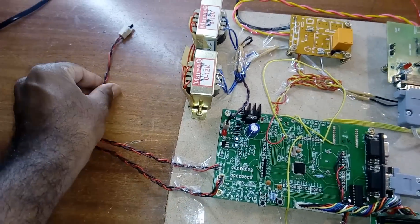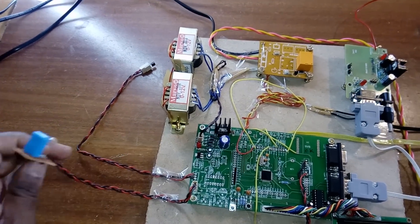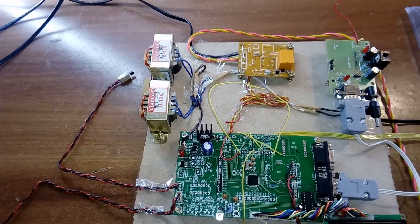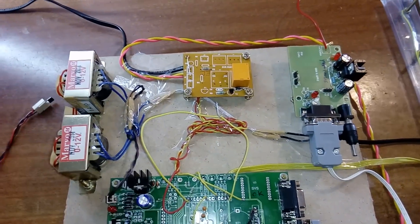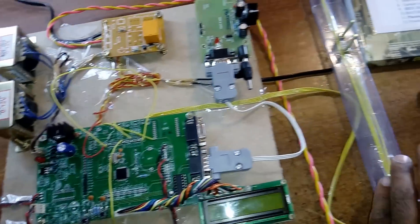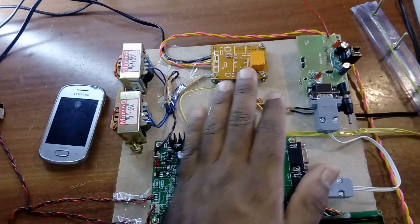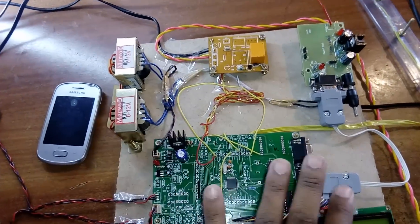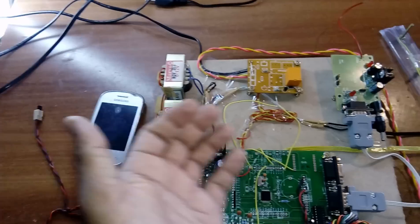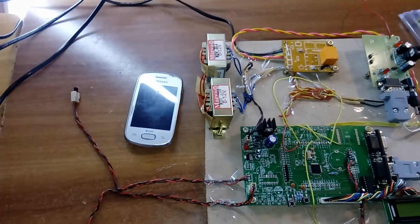We have two ADC inputs: the LM35 temperature sensor connected to pin P0.28, and the DHT11 humidity sensor connected to pin P0.30. We operate a relay connected to pin P1.16 to control the AC motor. Whenever there is no water, the system sends an SMS to a predefined mobile number. The microcontroller analyzes incoming SMS and turns the motor on or off. If something happens — phase open, insufficient water, or soil moisture full — the kit sends an SMS alert to the owner.